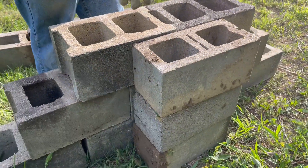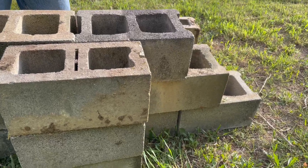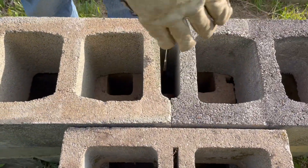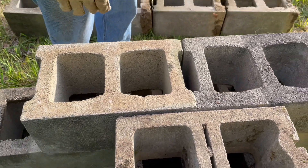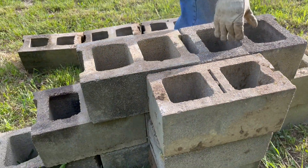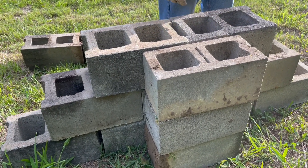When you do this, make sure you've got some rebar going down in it. Grout up the cores — fill up the cores to make it strong. That's a simple way to do it without using clips or anything like that, and it'll work.